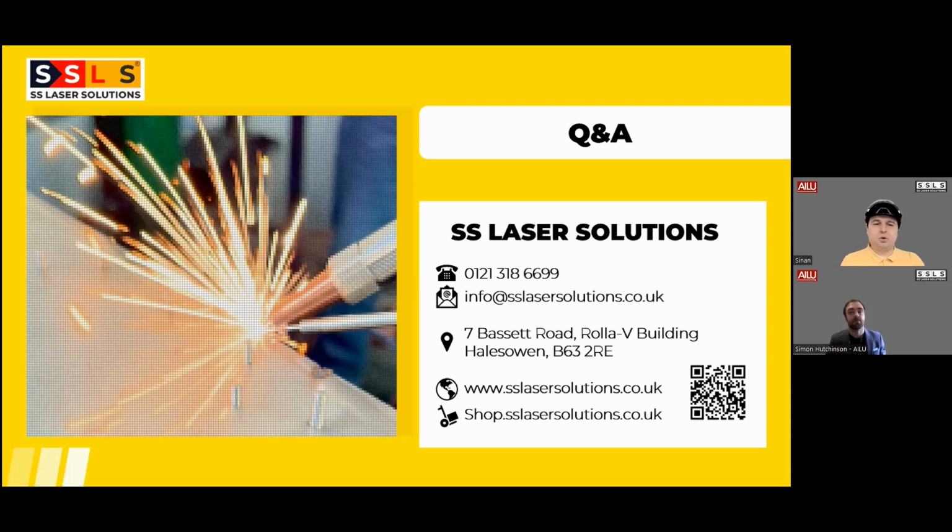On our machines it's not possible, but there are some machines in the market which are not fitted with a flow sensor or pressure sensor, so the operator can reduce the gas flow. And that is dangerous because the contamination can be quick. So our machines are standardly fitted with pressure sensors. You cannot reduce the gas flow below the safe zone. Otherwise, the machine will go into alarm mode and you can't run it. So we need to make sure that the gas flow is always good, so the contamination is out.